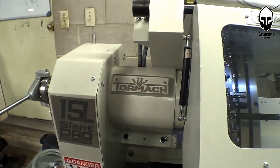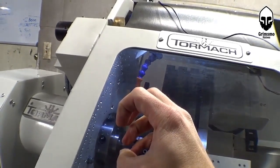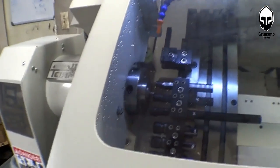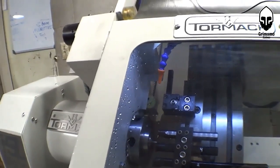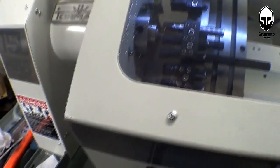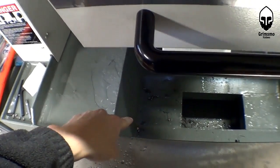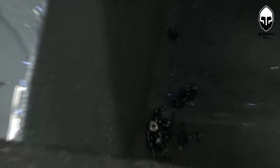The eventual plan is to set this up for automatic operation, so that happens automatically. A bar puller goes in there and basically grabs onto the end of the bar, pulls it out to a certain length, then it closes, and the bar puller pulls off. That way it can make however many parts can fit into that bar, completely hands-off — probably 50 or so. But for now, doing them one by one is not a big deal. Sometimes it takes just as long to find the part in the chips as it does to run the next one. You don't want to find it while it's running, but I can see it right there.